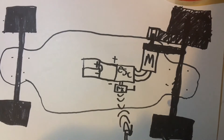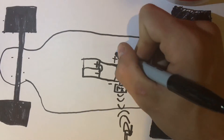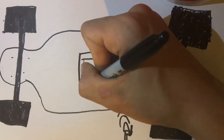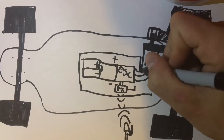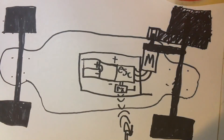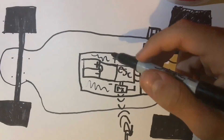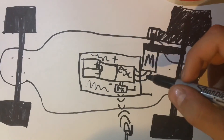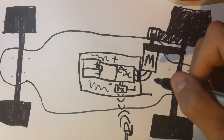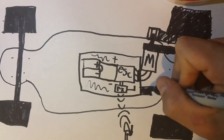Now, that is all you will need for the electronics, the motor, and all of the hardware. What I'm going to do is buy a plastic container to put this all in, and I'm going to make it look nice and clean. It will be waterproof — I'm going to put padding here to cushion the batteries, hold the ESC in there, and make the motor wires go into the box so that no water can get in. I'll have a lid I can pop off really nice and easily.